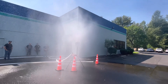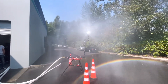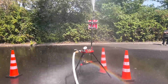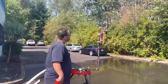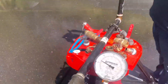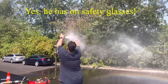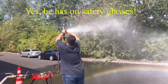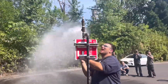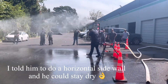That's a totally different spray pattern, and that's why we line the frame arms up with the pipes to this day. This is just a straight half-inch outlet — we're shooting about 40 feet in the air at a residual pressure of about 45 pounds. He's going to simulate pulling out a horizontal sidewall where we have about 66 pounds of pressure. He's putting his plug valve in there — he's got about 40 pounds of pressure and I'm 20 feet away getting wet.